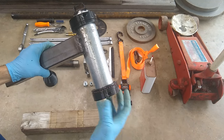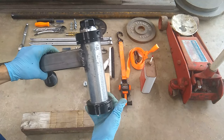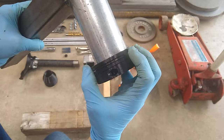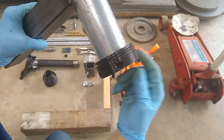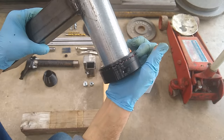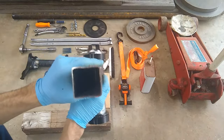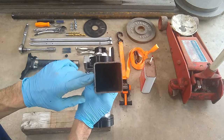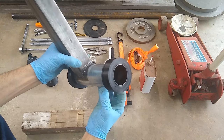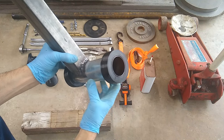I have a couple of bushings that go inside the pipe, and the thrust bearing is a 3D-printed part with holes going all the way around it. I'm using BBs — just air rifle BBs — as my rotating mechanism, and it works really well. The tubing is 2x2 square tubing, 14 gauge, and this is some 2¼-inch fence post that's a sixteenth of an inch thick.